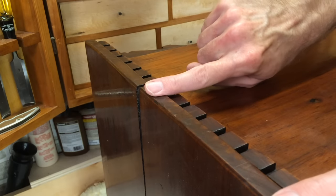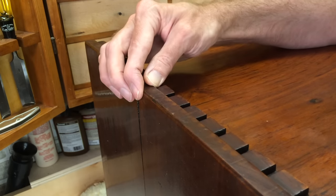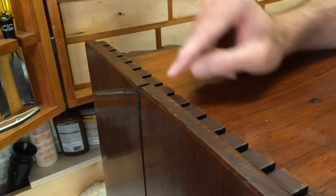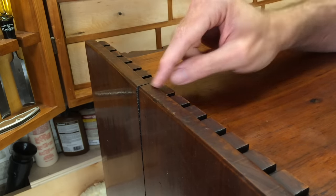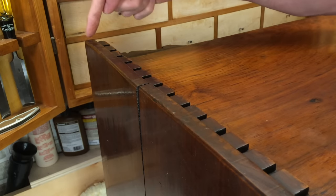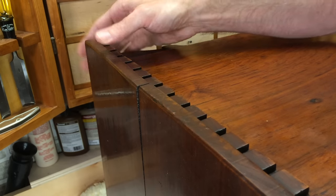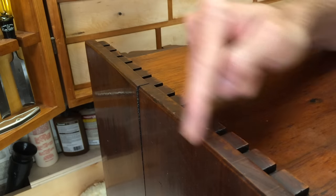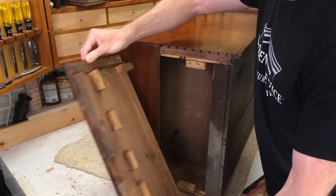With the screws out here, this part here, I can now slide closed. So this is what should happen. This wood should move back and forth to allow for seasonal wood movement. The reason this part has to move here is at the front here, it needs to be tight, so all the joinery here stays tight. So this is fixed, this is floating. So I'll need to pull this apart and get some glue in there so I can re-glue the top.